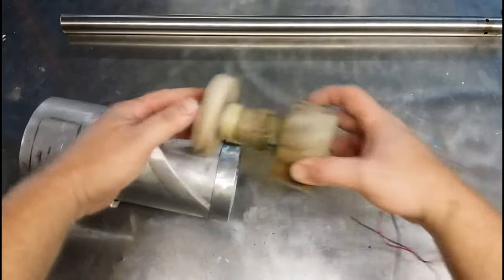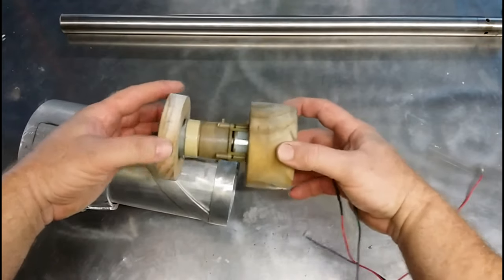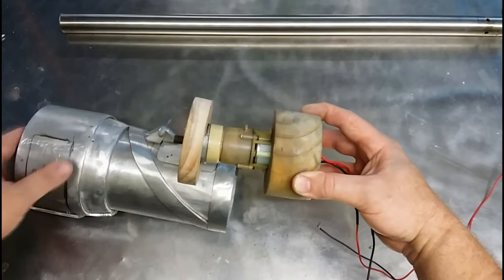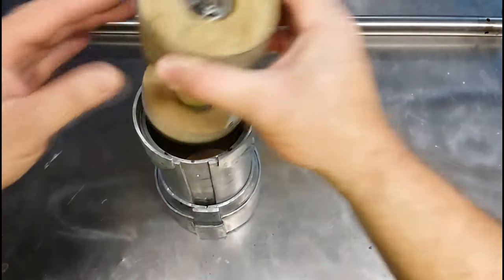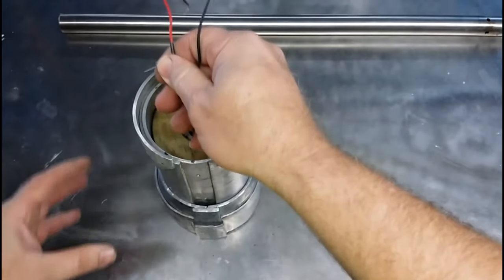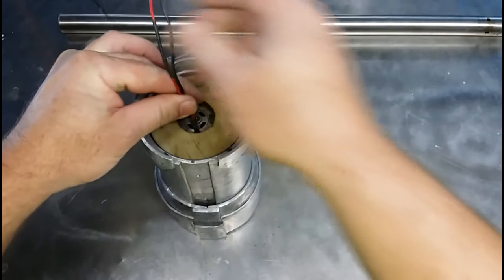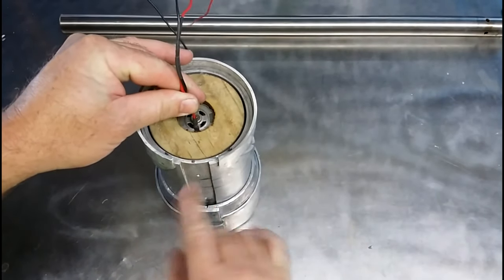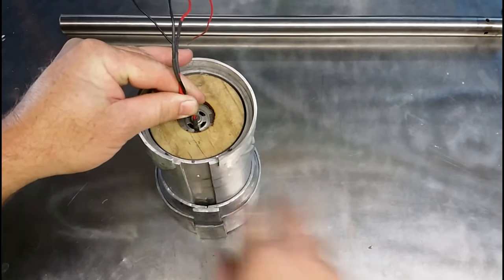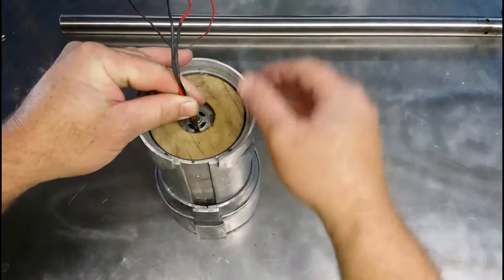And I've done a similar thing with the actual motor assembly itself, where I've got a larger and a smaller sleeve that just holds the motor in the center line position so that everything lines up when the barrel comes out the other end. And that simply just slides down into the center like that. Where it's actually going to be mounted is around about in that position. And whilst that gap is a bit large at the moment, that's where the wiring will come out and run back to the battery and up to the trigger component on the handle of the gun.